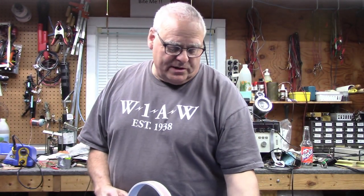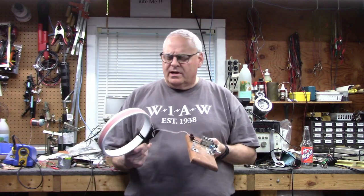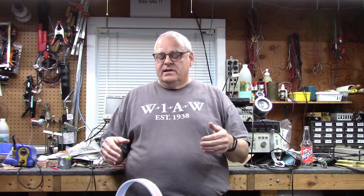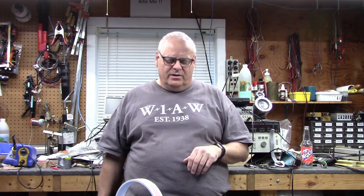I hope somebody enjoyed that. A couple of notes: if you build a loop that is two feet on a side — like an X loop or a box loop — and space the turns maybe a quarter of an inch apart, the Q will go up. The selectivity of that loop — I keep calling it a filter, because it kind of is — will narrow down so steeply that you can almost pull one sideband out of an AM carrier from the other. I've had that happen with loops that were too high a Q. The problem is if the wind blows or it gets wet, it spoils the Q and detunes itself.